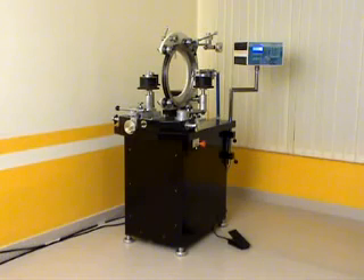final OD of 430mm and final height 175mm. Using this machine, copper wire with gauge 0.8mm to 4.7mm could be easily wound. The power consumption of the machine is 2.3kW, operating voltage is 230V 50Hz, and the current rating is 10A. The main motor for winding is 3-phase AC 2.25kW at 1400rpm. The co-rotation motor is a stepper with a torque of 125kg·cm. The maximum winding speed is 150 turns per minute.